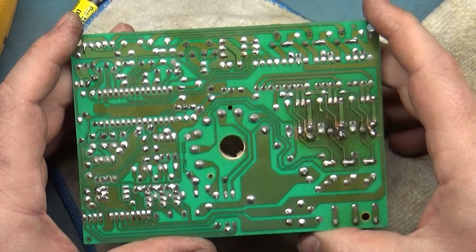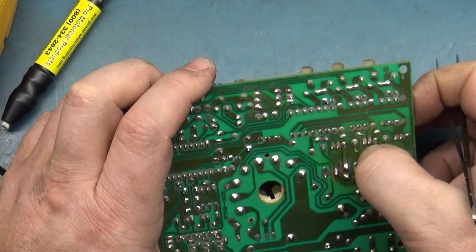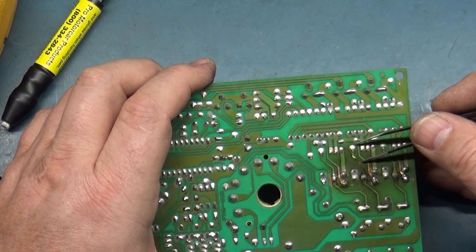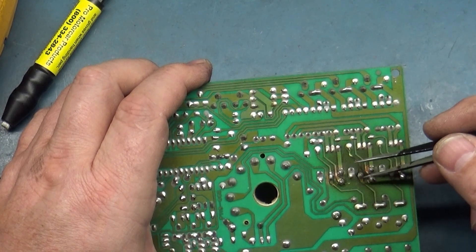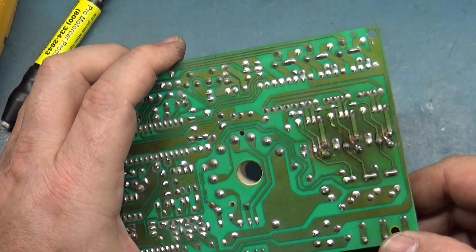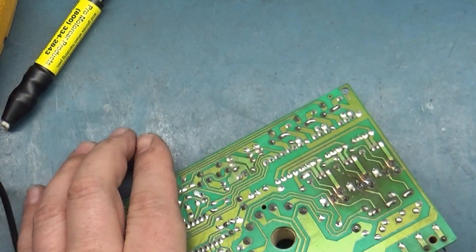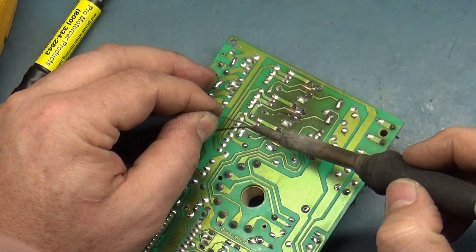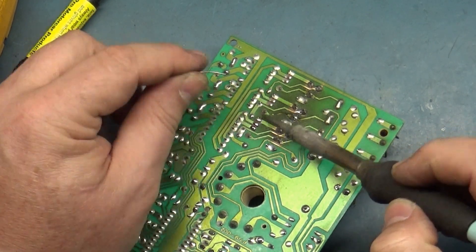Now we have a clean backside. We're going to end up having to glue this back in place after all. Actually, I think I'll just solder-mask it back in place because I have to cover up with solder mask and all this other stuff. The rest of these joints all look fairly good, so I'm not really too worried about reflowing those. I guess I could hit these transistors real quick — I normally hit those.